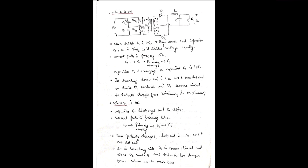On the secondary side when S1 is on, the dotted end becomes positive and the non-dotted end becomes negative. The same polarity is induced on the secondary side, so diode D1 conducts and diode D2 is reverse biased. As D1 conducts, inductor Lx charges from minimum to maximum.